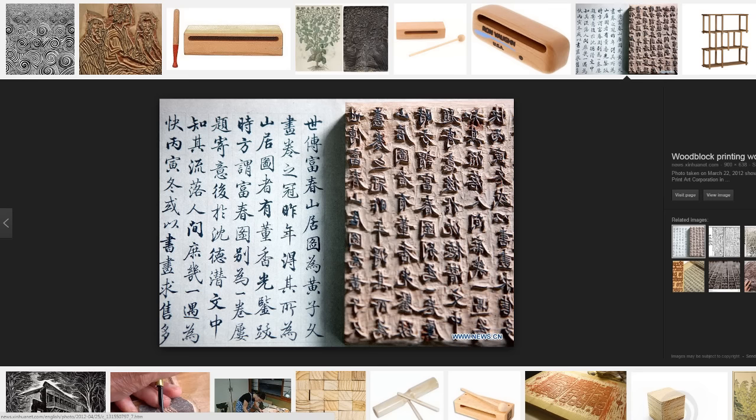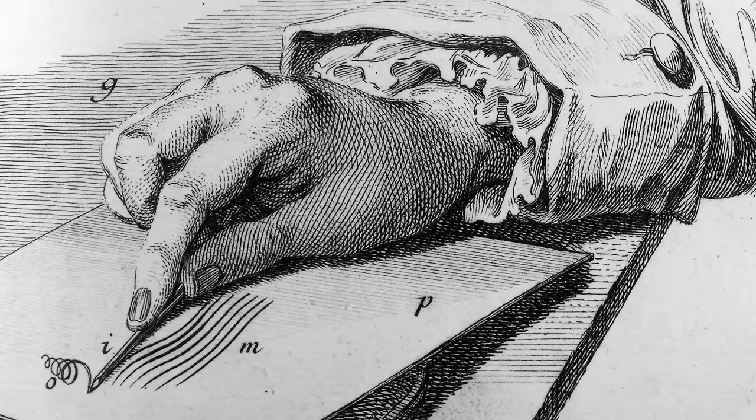And it's got nothing to do with engraving, except that you could do this sort of engraving on a CNC mill type engraver. That's milling rather than engraving, because the real engraving looks like this. It is a metal plate that has been cut with a sharp tool and engraved into little V notches. Those notches are called intaglio. I think it's Italian for valley.